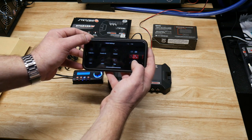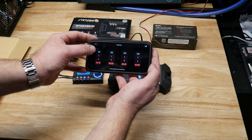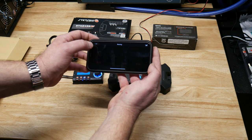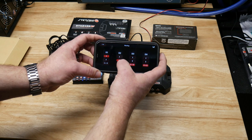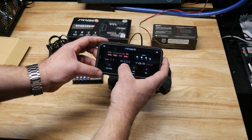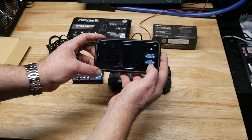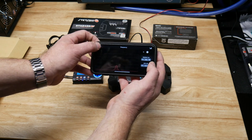There's phase control — check out my Expert Electronics DSP video for more in-depth on that. There's also routing, so for example on channel one output you can choose whether you want both left and right signals to output, or do it in stereo so channel one outputs only left and channel two outputs only right, et cetera. The layout is a little nicer here. It also has a test tone generator, so if you want to play a 40 Hz test tone you can do that right from the app.